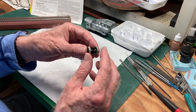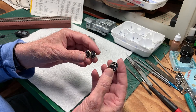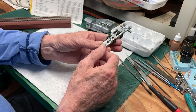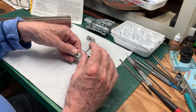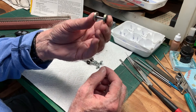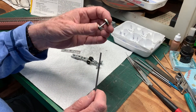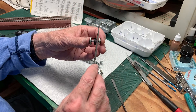Next we're going to be getting these drivers and the axles up into the frame so they roll smoothly - that's something that's really critical. They just go in the slots in the frame like that, and the cover plate goes over them to hold them in place. When the axles were taken out of the box they had a little bit of corrosion on them from sitting in the box for 20 years, so I hit them gently with a fine tooth file and got them all shiny - probably removed just a little bit of stuff that didn't belong on there. Same thing for this other one, although I had to use a narrower file.